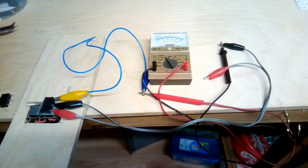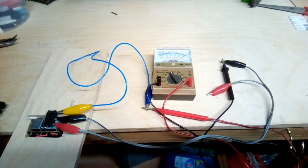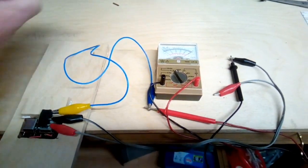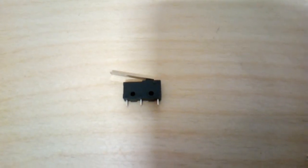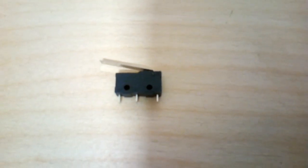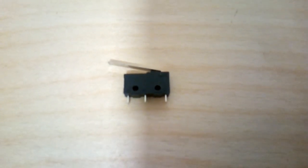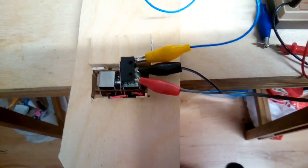So with regard to the new micro switches that I bought, I'm going to try and use them in place of the Peco PL13 sliding switches. I've been told that the micro switches are much more reliable, but it's a question of mounting them on the solenoids. These are the micro switches that I bought from Layouts for You. They're just £1 each, and they're the long-armed variety. I don't know whether that is the right one I bought actually. I might have bought the wrong ones. I should possibly have bought the short arm ones. I'm not entirely sure about that, but anyway, I've rigged up a bit of a test, because I didn't fancy scrambling underneath the layout to try and fit them on before I knew what I was doing.